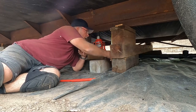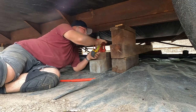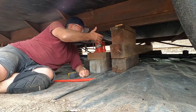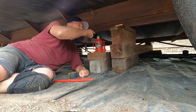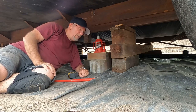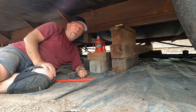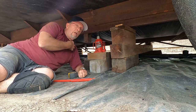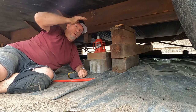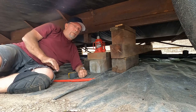Two and a quarter — exactly right on the middle of my laser mark. That point is good, we're done. Now I just go around to each crib like this. Moving by myself, I probably won't get this done in one day — looking at two days. But again, twelve to thirteen hundred bucks saved. It's easy money that you can spend somewhere visible, like cabinets, light fixtures, or floor coverings. Nobody sees this work, but it's important because everything is going to be level before we start the new work.